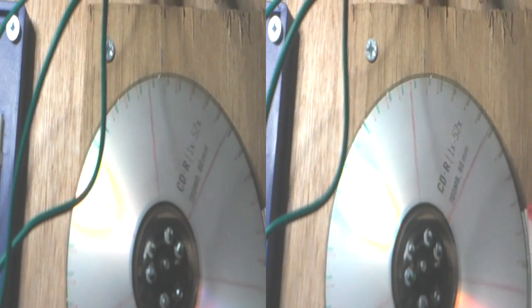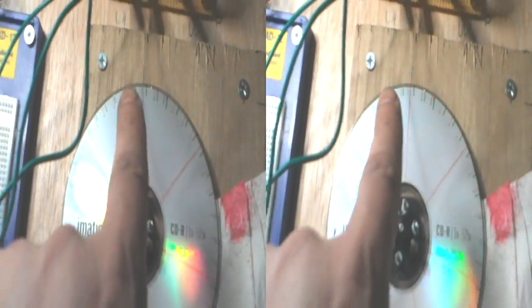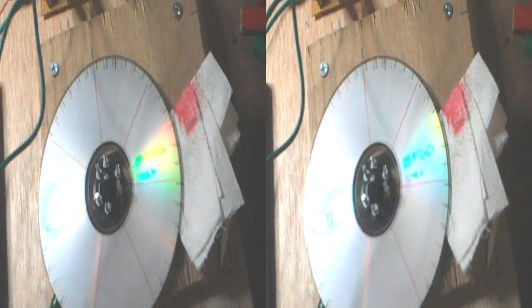Yep. Now we've actually got this motor running, obviously pretty stationary on 3 volts, and I can feel through those bolts that the coil's getting a bit warm. But that's only so that it provides enough locking current, so it steps correctly. So we've got the wheel marked up, effectively, and then we can use those markings to mark up underneath, so that we know where to put the sensors as well.